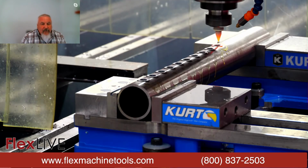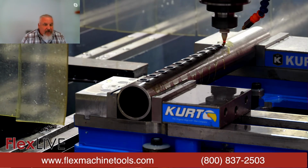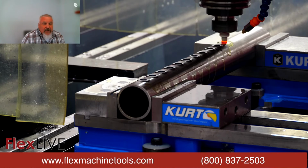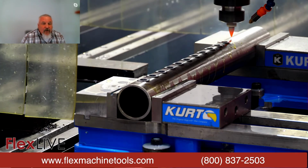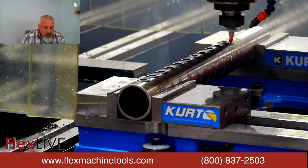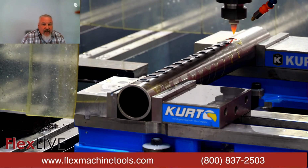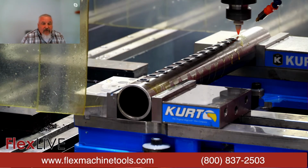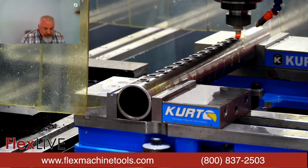We offer any type of thread that you may need, be it a standard thread, a metric thread, NPT, BSPT, virtually any thread size that you need. We can make up a flow drill bit to do that thread size for you. Again, we can hit any dimensional change. If you just need, say, a press fit for something, we can meet those tolerances as well for you.